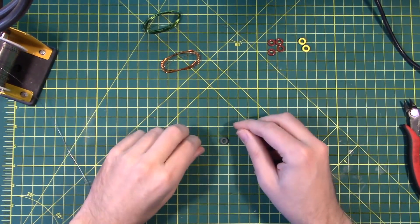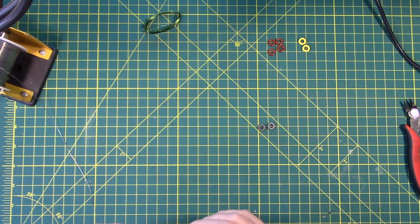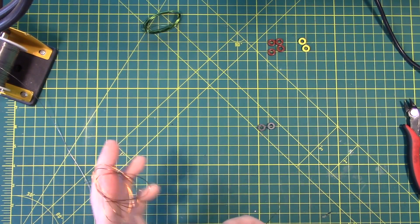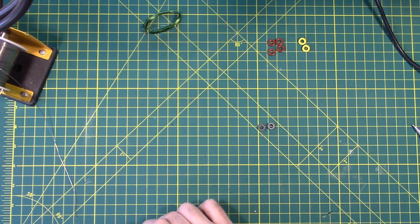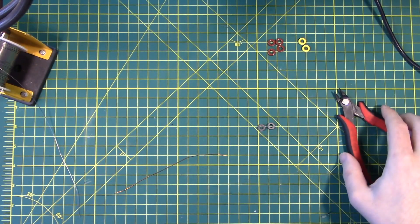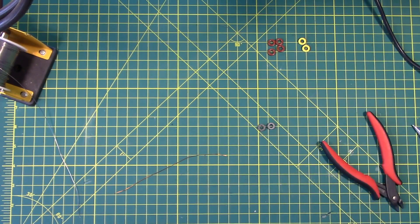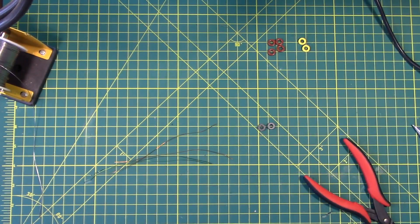Toroid time. The first two toroids go on the main board and they're black on both sides, which makes it easy to tell which is which. You need about six inches of both colors of wire supplied. This is magnet wire and it has a thin plastic coating on it. My work mat has a built-in ruler so we'll use that. The length of wire is really only important because of the number of turns you want to put through the core, not because of a specific length needed to tune the band.